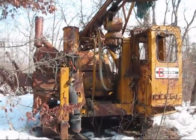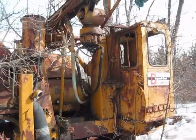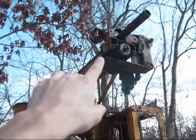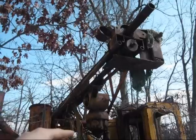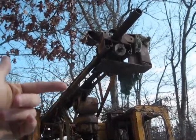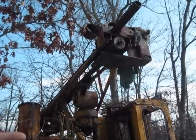The DM3 had a bit loading of 30,000 pounds. You can see the mast leaned back over the drill there, which is what the steels are connected to. The drill head on a DM3 was either a model DRD or a DRD2.